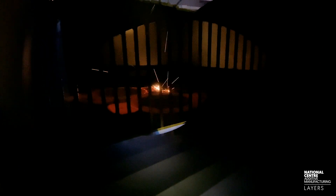Moving on to a more complex section of the build — about 70 millimeters up — you can see the beam moving across the build and it looks like there are multiple beams, but that's just one beam moving so quickly. It does this to maintain a good, consistent bed temperature across all of the parts, which helps not only with material quality but with part quality, ensuring each layer throughout the build is as close to all the other layers as possible. It's all about keeping that part quality consistent.